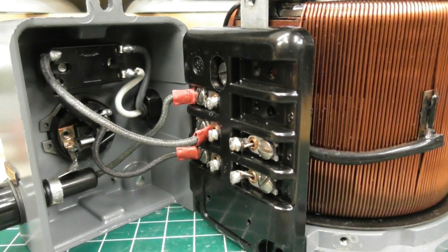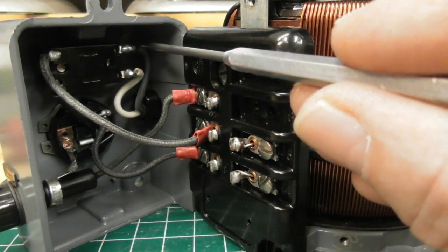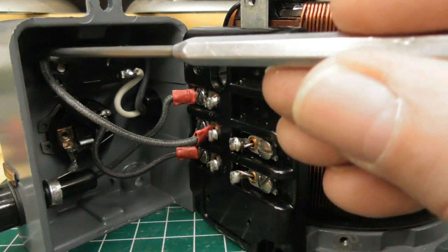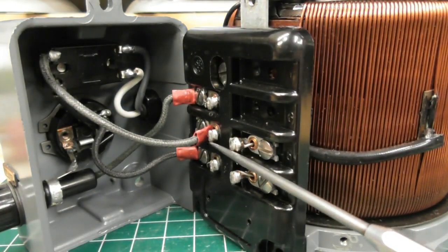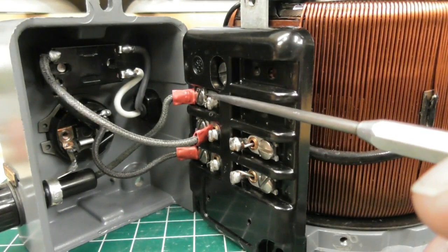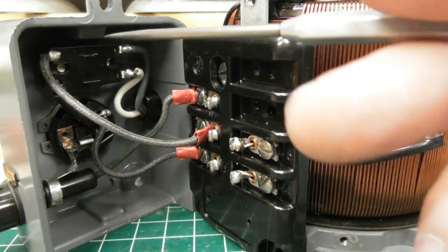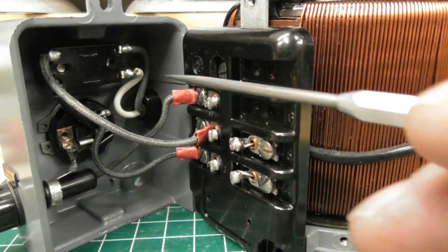I'm going to start with the lines coming in. You can see the positive 110 coming to that side of the switch, and the neutral is on the bottom — the white wire. The positive feeds straight through the switch; it's the only wire on the other side, and it feeds to terminal two right here. They are numbered from the bottom: one, two, and three, and then four and five, which are not used as you mentioned. So after the switch, it goes to terminal two.